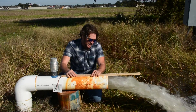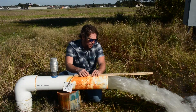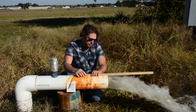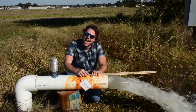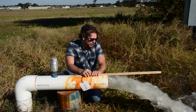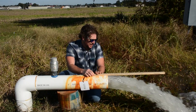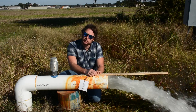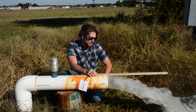We push out until we come to the point where the top of the arc of that water is just barely hitting that 8-inch plumb bob. You keep pushing out and keep pushing out to that point — right about there — where you can see we've just barely got movement.